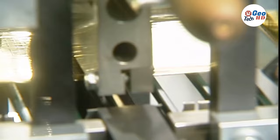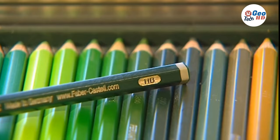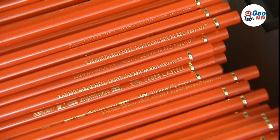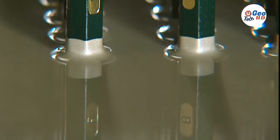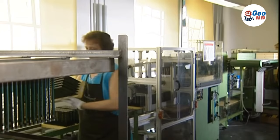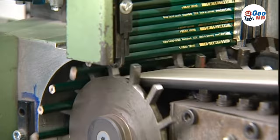Continuing along the conveyor belt, half of the slats are coated with a layer of glue, and the cut graphite is laid in the grooves of these slats. The slats without glue are placed on another belt that carries them to a machine that picks them up and turns them over so the grooves face down. The two conveyor belts then meet, and each unglued slat is placed over a glued slat with graphite, forming a sandwich. After the sandwiches have been removed from the conveyor belt, they are placed into a metal clamp and squeezed by a hydraulic press, and left clamped together until the glue is dried.